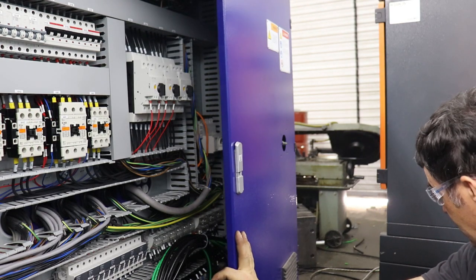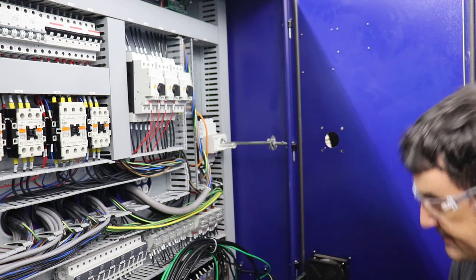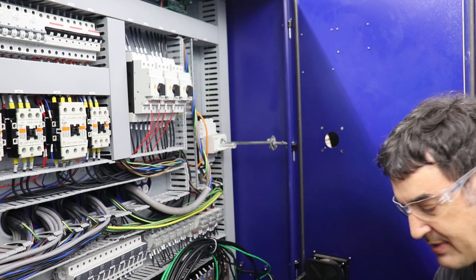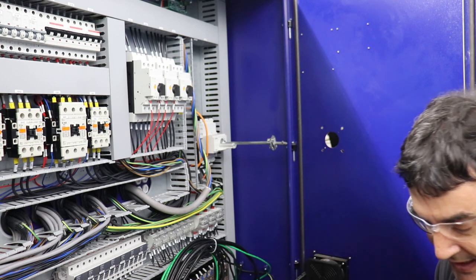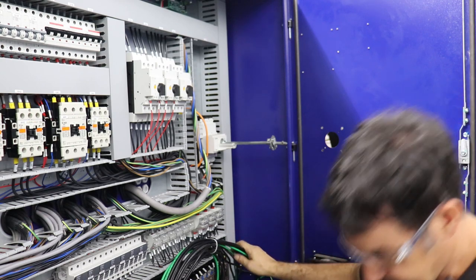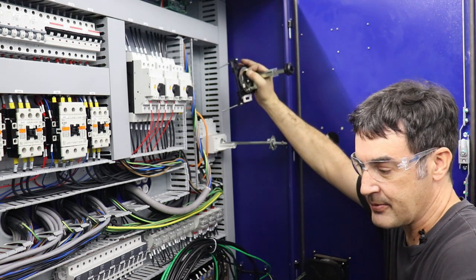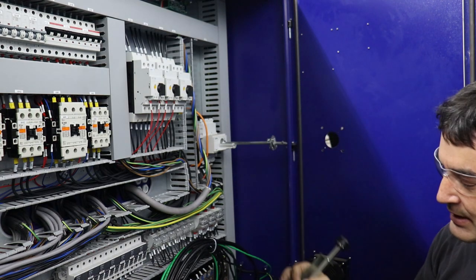In our case, we have two power inputs, one for the motors and one for the heaters, but only one circuit breaker switch, and you can't really rely on trying to match phases and break the power from two different panels in your machine itself. So what we have to do is add a second circuit breaker for the second power input, also with a second door switch that pokes through the outside, so the machine needs two switches turned off before we can open the cabinet.